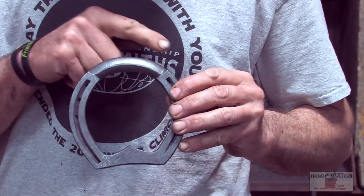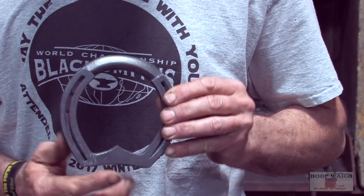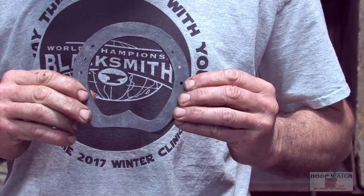This is the first video of the individual class, which is two shoes. It's the L Brand Forge Coke, proud sponsor of the WCB. And we're making the inverted bar shoe, Diamond Toe. It's 14 and a half inches, a 3/8 by 3/4. And it measures 5 1/4 wide by 5 5/16 long. It has a diamond toe. It's an inverted bar on the bottom. And it's punched for 6.